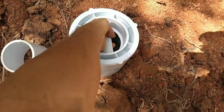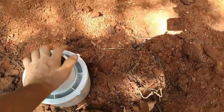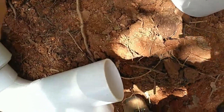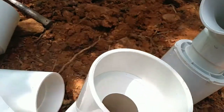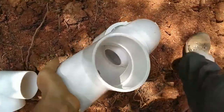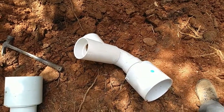Again, six inch to four inch. I used an inch and a half PVC because it's the flattest piece. I cut a piece and shimmed it into that area. I took a short stub, pushed it in there, took a street 90 and hooked it up to that. I take the ball, the ball goes in there, and then the section with the chamfer for the ball fits on that — and there's our first flush check valve.